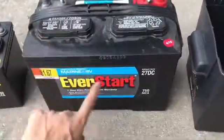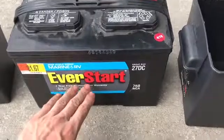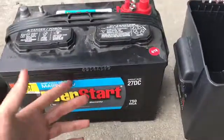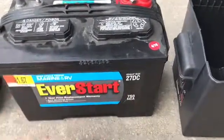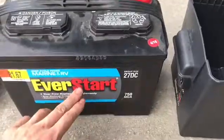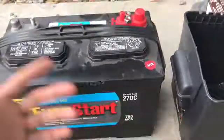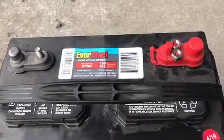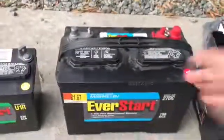That's about doubled capacity, which is what you want to do with one of these batteries — you don't want to discharge them more than 50%. That's going to extend the life of the battery. Some people even say about 70%, meaning you don't want to discharge more than 30%, but 50% is more the standard. 70% can get very expensive if you're oversizing by that much, but you really want to keep these things as topped off as you can.